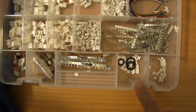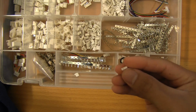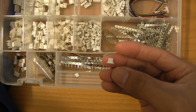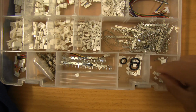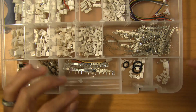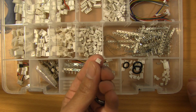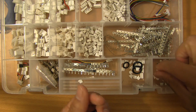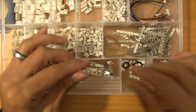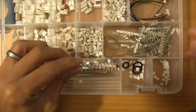Down here are the JST SH housings for the Open Pilot gear, and you'll notice they tend to be just a little bit longer than the Picoblade housings. The Picoblade housings are over here. Now, just a quick tip: when you're searching on digikey for these housings, and when you find the product, there's a section in the descriptions that show mating products as well as associated products. And a lot of times, you're going to need to source the associated crimp pins that go with these.